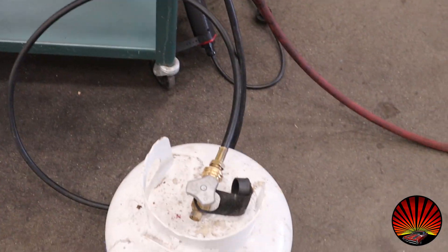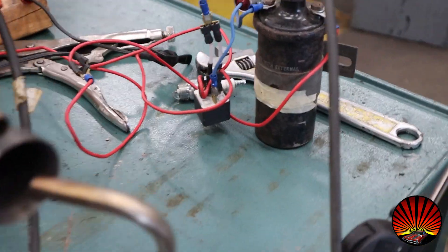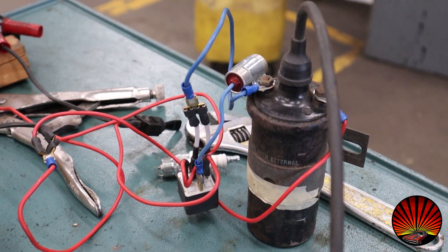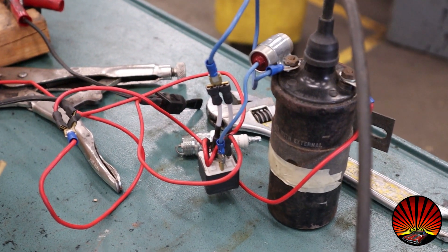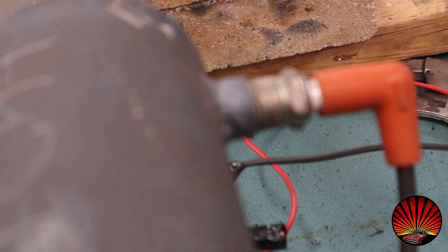Let's get this thing going. We're using propane for fuel source, I'm gonna use an air hose to get the air started in this thing, and I've got a little setup with a relay and a coil and a capacitor for making basically like an old Ford ignition style system where this spark plug will just keep zapping in there.